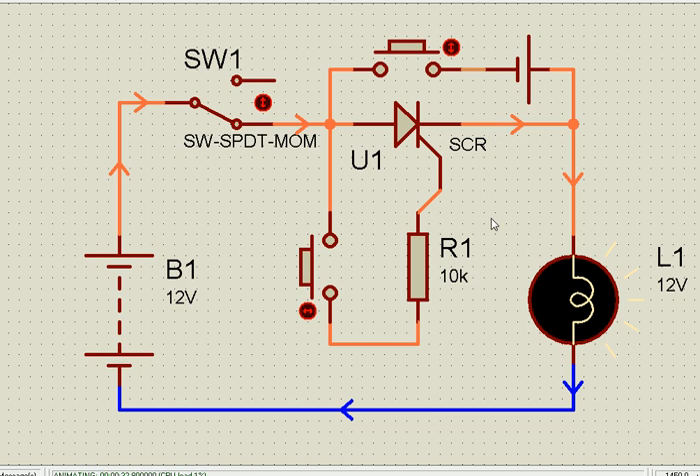When can it stop? The stop arrangement can be done by two methods. One is I momentarily open the circuit and then close it again. See, the current stops. I have momentarily opened it and closed it again — the current stops. Now unless I trigger it again, it does not flow. Triggered means I just passed for a brief period the current from gate to cathode.